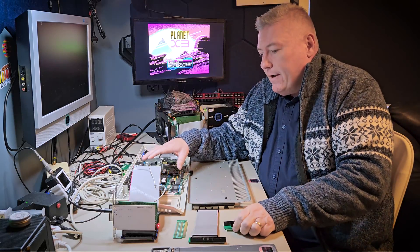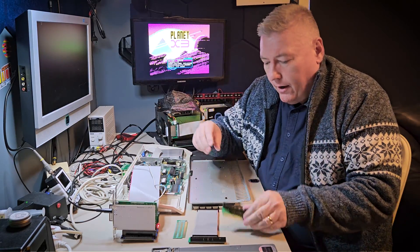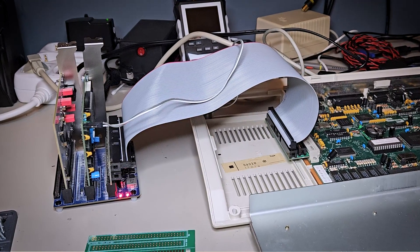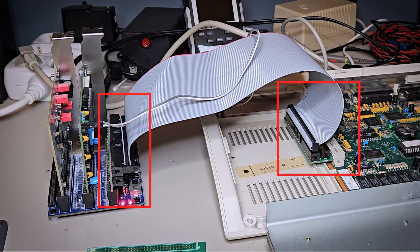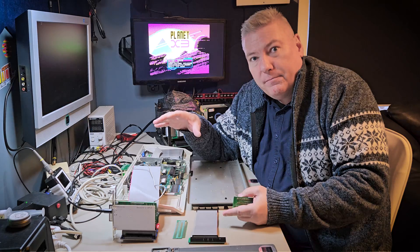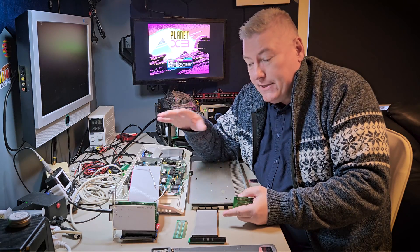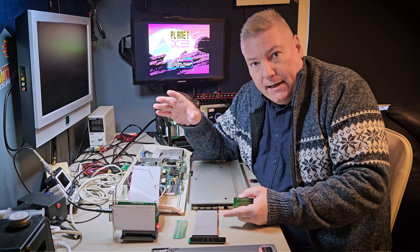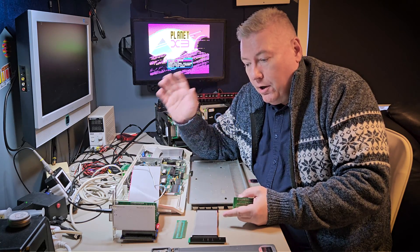What I've done here is connected the ISA bus adapter to the ISA bus — the one and only ISA bus on this Euro PC. And then with this 64 pin cable, we have another adapter, just the same, going into the ISA bus card. You can use any ISA bus card, but we are using this one that is sold by the 8088 book guy on AliExpress.